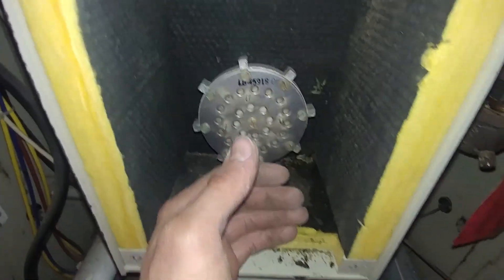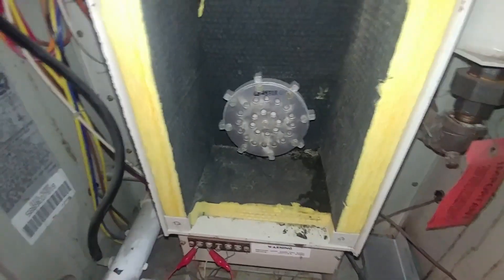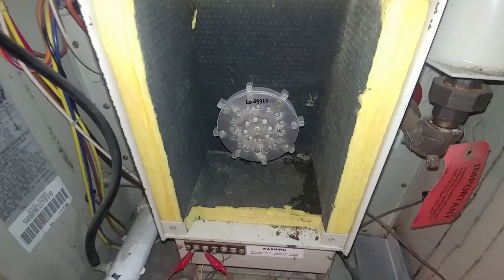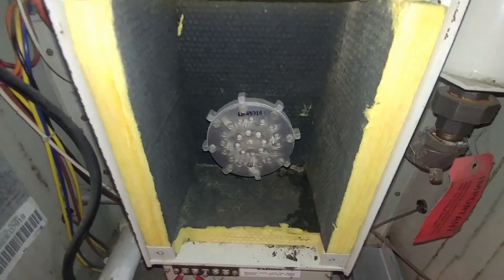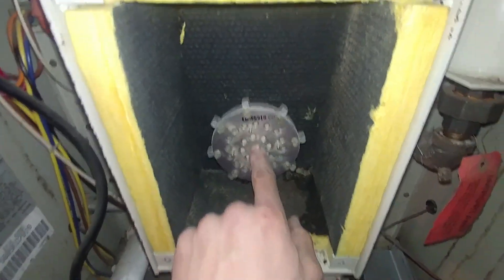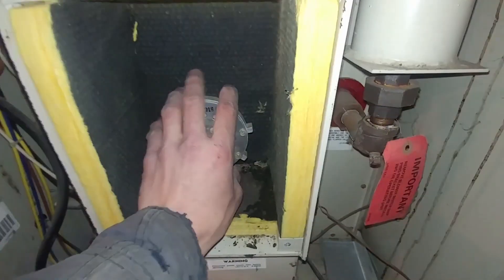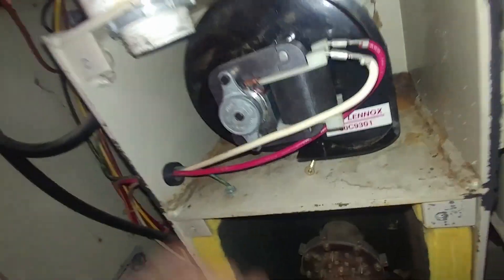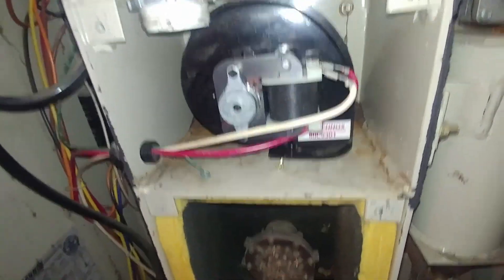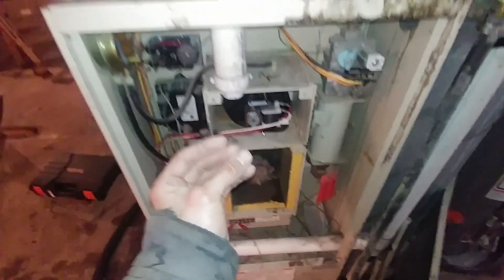So if you feel right here, it feels like a really loud speaker. Because that's vibrating so much, it's actually a lot like a loudspeaker — it's a lot like a horn. And this doesn't get hot unless this thing is turned off. I'm not really scared to touch this because this just mixes the air, because our gas is entering over there. It's really a neat furnace, especially while it's running. Notice again, this is turned off because that's just a pre-purge blower — it does not actually need to run while this thing is exploding, because that pressure just pushes all the exhaust gases out.